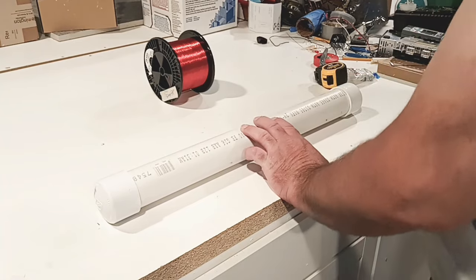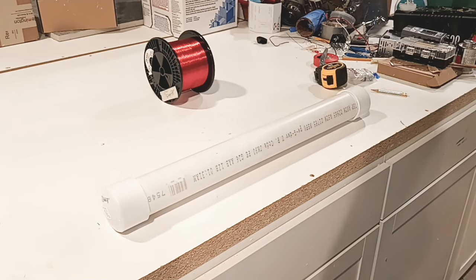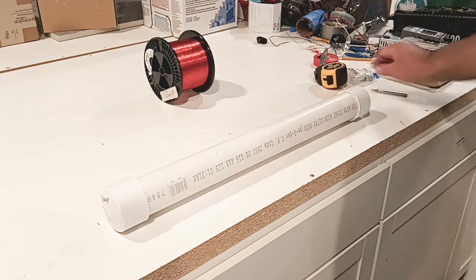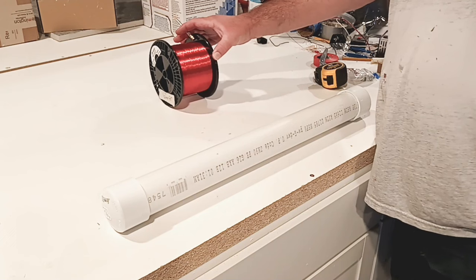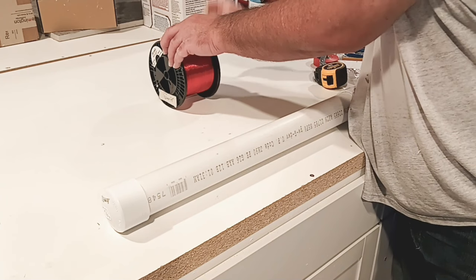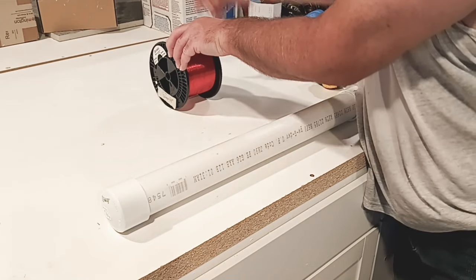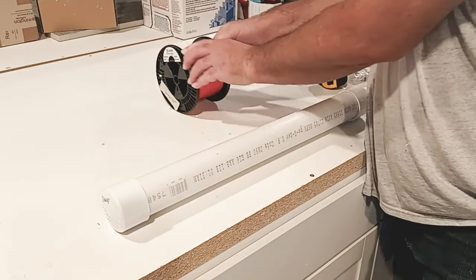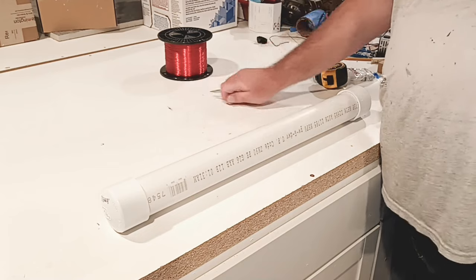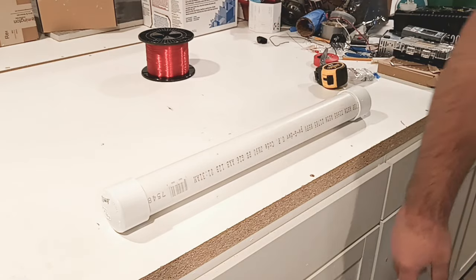You don't want much. Our jig is going to be collapsible, so you're going to be able to take it and remove one side of it. So don't get concerned about all the distances, as long as we get in there and it's not binding. Okay, this one here, we want it about what, that much off? We'll mark it. Same way here. Mark it. Make sure this is lined up. Yep. That right there. That distance is what we want. A little bit of room on each side won't bind. But tight enough where it's not going to wiggle everywhere.